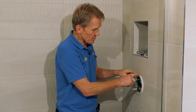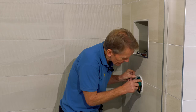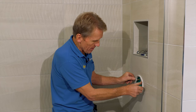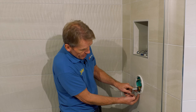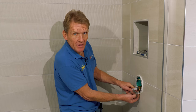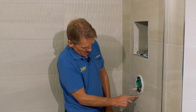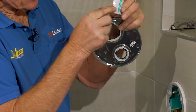Tighten the screen very gently - they're plastic screws and you just need to squash the gasket against the tiles, which even goes into the grout line. There's a clever little weep hole at the bottom where the gasket is missing - any water inside the shower valve enclosure drains out there. If you see a line of water running down there, you know something is amiss with the valve. They supply a little bit of silicone grease - just a little lubrication to help things along.